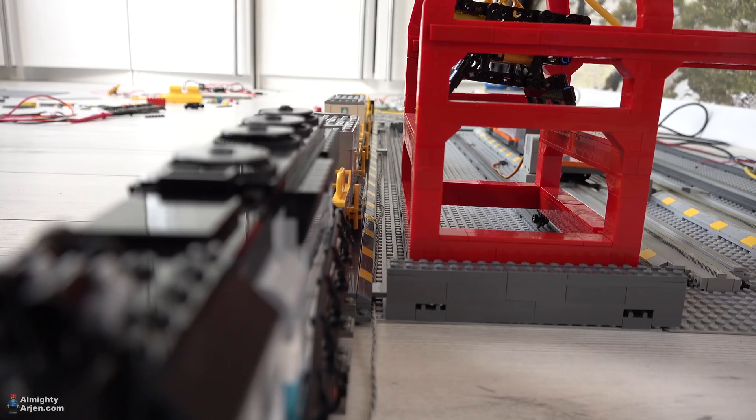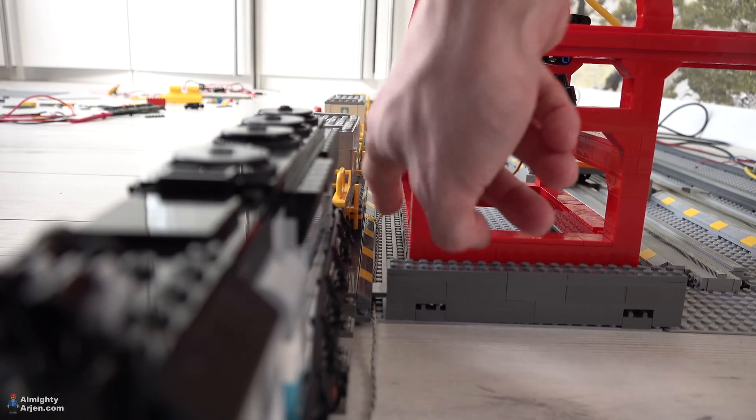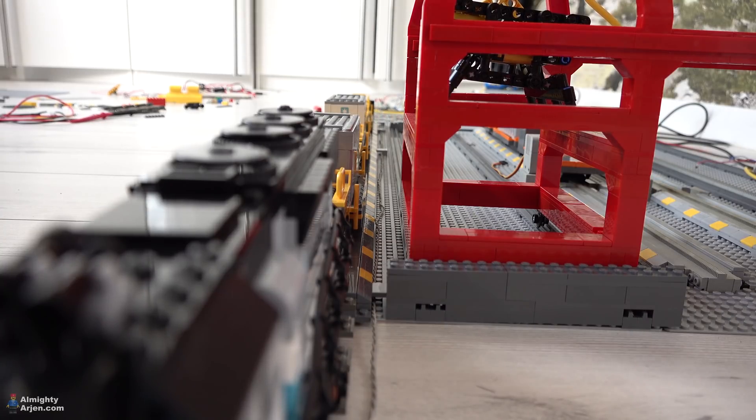But there was one comment from Marien's pack about offsetting the crane. I already thought about that but in a very complicated way, and I was avoiding the solution because it seemed like a lot of work. But Marien came with a very simple and good solution: you put a magnet on the side of the wagon and a reed switch on the crane. When the train stops, you move the crane forward until the reed switch detects the magnet — that's your starting point and your offset point. I think it should work.